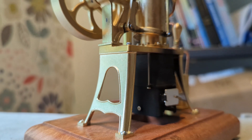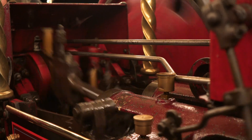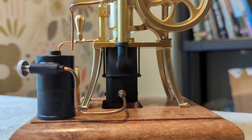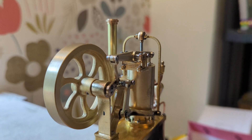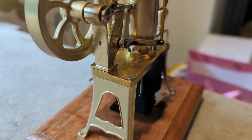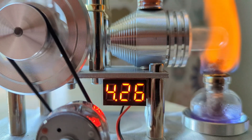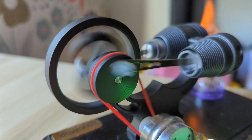This is also much more efficient than a steam engine. The typical steam engine is somewhere in the region of 5% efficient, whereas a hot air engine is more like 30% efficient. You just have an open flame, which isn't the most efficient thing, but the engine sits on top of that so all the heat that rises is being used to run it. All of this sounds really good — and for the time, this was groundbreaking. The problem is they're not actually that powerful; they have next to no torque. Compared with my other Stirling engines, they have about enough power to generate electricity to run an LED. And if you start scaling up, it turns out they don't scale particularly well — a theoretical 300 horsepower engine was the size of a small flat, compared to an internal combustion engine.